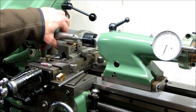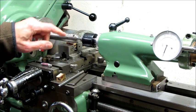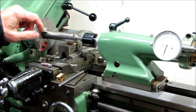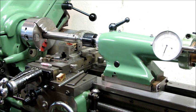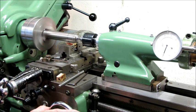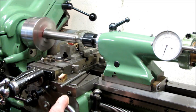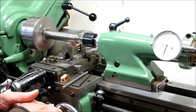This boring bar is made from a piece of 1-inch steel rod and some hardened tool steel for the cutter. We'll attempt to begin the cut on this first pass. We'll turn on the lathe and see how this goes — this may be a little rugged on this first go, but actually we're just skimming it. You can hear it just skimming now.